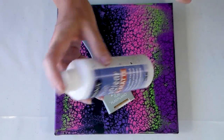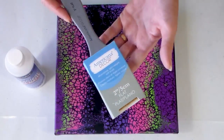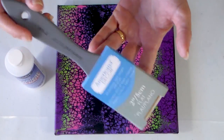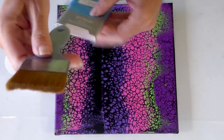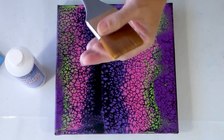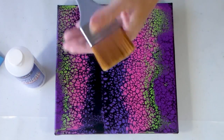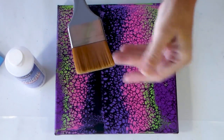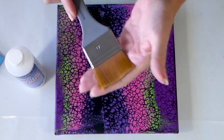If you shake it too much you can end up with a lot of bubbles in your varnish, and those will translate onto your work surface. This is the brush I'm using — this is another Americana brush, the two inch flat, and it's ideal for varnishing. I even keep it in this little sleeve so the bristles stay nice and soft and flat and don't get bent. Make sure if you've got any bristles sticking out or bent to get rid of those. If you're using a varnish brush, this one is very high quality so none of the bristles come out when I pull on it.